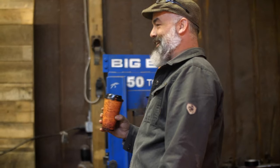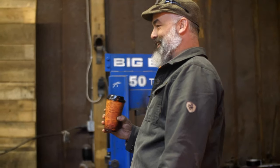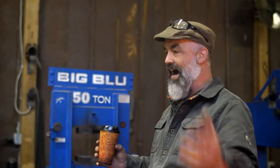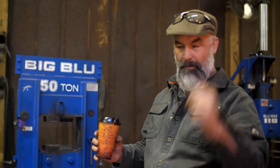It's a good question. There's a lot of questions that people ask, and they're elementary questions, but they're good questions. So what's the importance of normalizing? Normalizing is exactly what it sounds like, normalizing the steel. Once you've done your forging, you have all these extreme temperatures, all this violence that you've put into your blade, you're beating it, and you're shaping it, you're moving it. And now what are you gonna do? You're gonna go grind it and harden it?